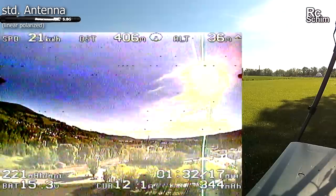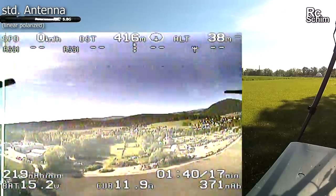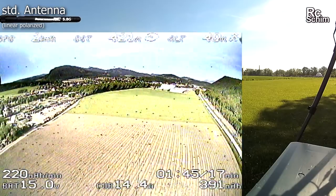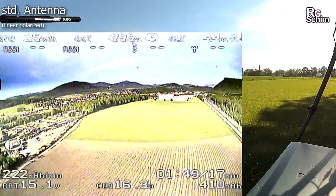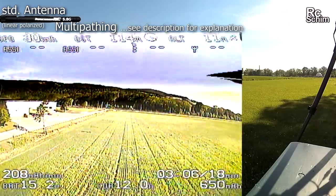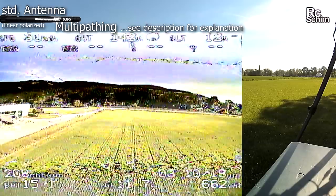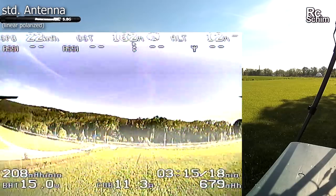I have the antenna facing straight and now my quad is also straight. That's about as far as I feel comfortable - let's say 420 meters, which is not too bad after all with 25 milliwatts. Although with this large building to the left you get a lot of multi-passing. So that's why even at 100 meters we have some reflections and ugliness. I expect the other antennas, the circular polarized ones, to be better.